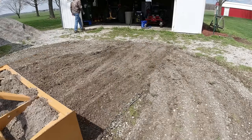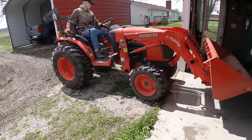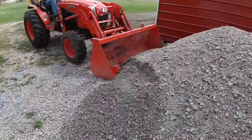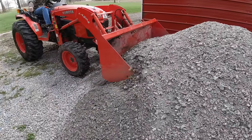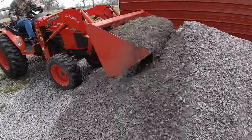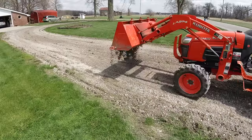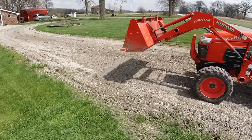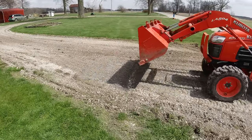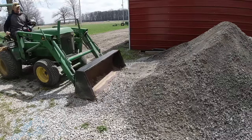As I start filling the box a little bit, that takes me to step two: cut and fill. Here I'm going to have my neighbor help with his tractor to utilize a pile of number 73 crushed limestone that was already on site. This is a chance for both of us to use our front end loaders to make short work of this six or seven ton pile. His Kubota is actually better equipped for this than my old John Deere, but I still make a go of it.